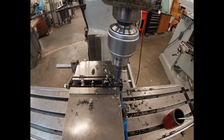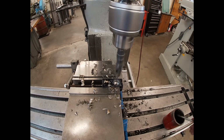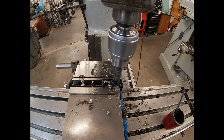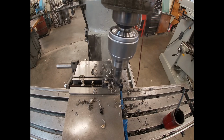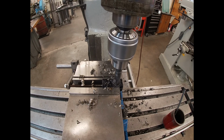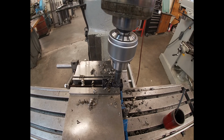And then of course, I mentioned this in the previous video, but at this point I am absolutely using thin parallels because of a 1-inch part, a 3/4 inch reamer, and the standard parallel width of 1/8 of an inch would leave zero clearance. And since my 1-inch part is off the rack stock, it's actually likely slightly smaller than 1 inch. So pay attention to your work.